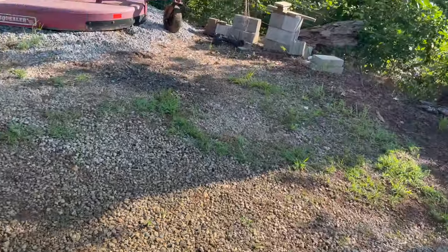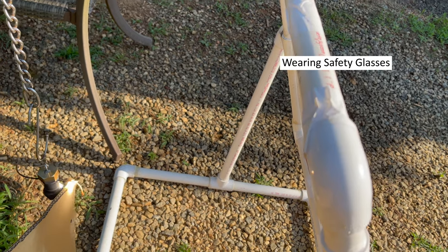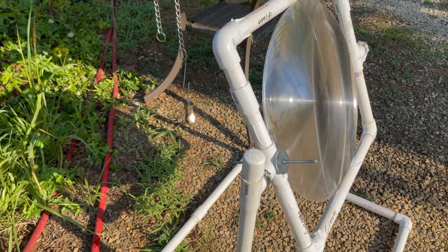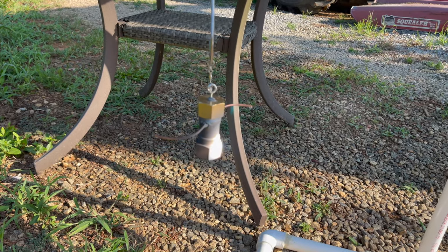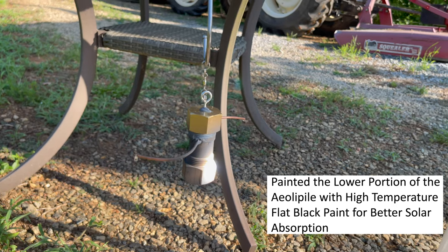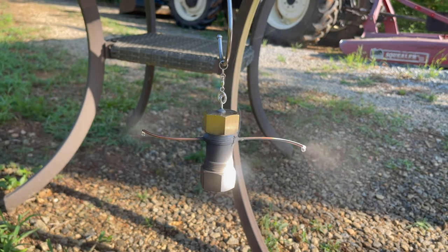It's morning — partly cloudy right now, relatively clear, about 8:52 AM. I'm going to try the new Aeolipile with the Fresnel lens. It's definitely hot enough — it didn't take long — so it's going to work. It's starting to squirt water out of the nozzles. To make this more compatible with solar heating, I painted the brass flat black with high-temperature paint so it will absorb heat rather than reflect it.